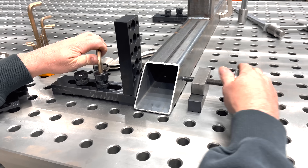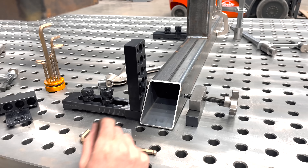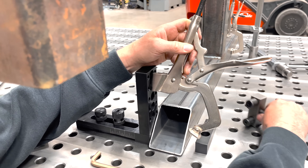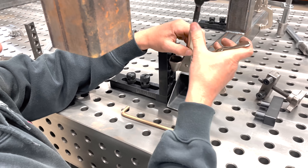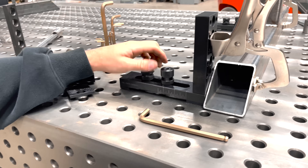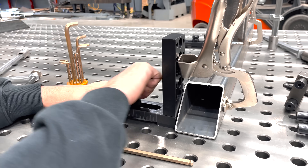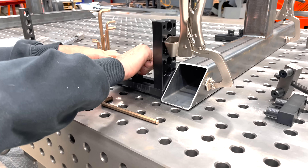So this is a bad practice when pushing into a sliding fixture. I opt to actually use the fixture itself — and when you use the clamp inside of it, this achieves the same exact thing but doesn't put any force on the fixture whatsoever. Now you can see I can actually slide this back and forth, but there are no side forces that are going to accidentally push the fixture out of position.